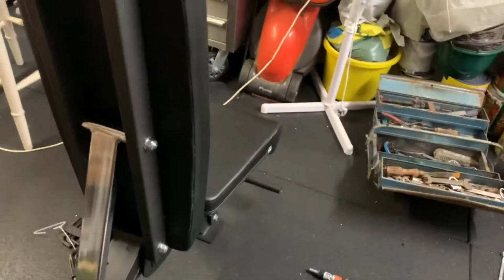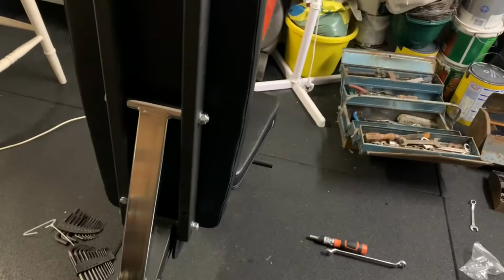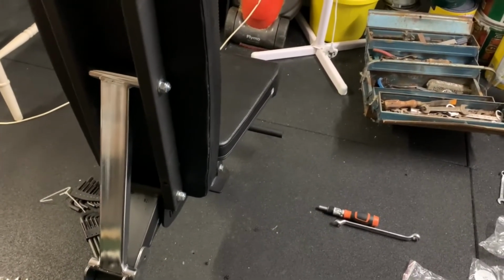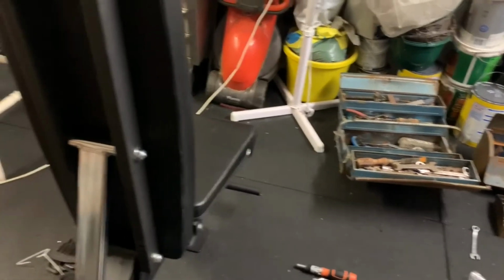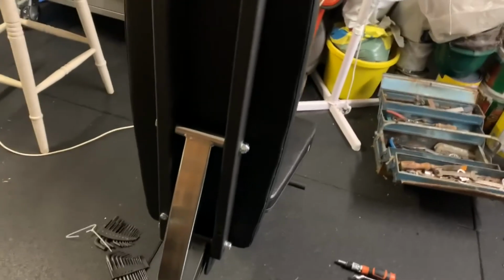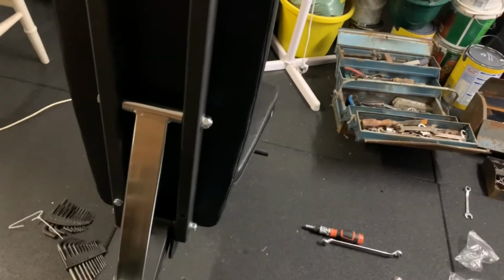You see, there's 1, 2, 3, none, because that hole just does not line up. The hole in the steel, there's just absolutely no way to get both of those screws in down there. And I can't even re-drill it in the wooden base because there's a brass insert, or it looks like brass anyway, in the wood for the screw to bite into, which works really nice on these. They're very tight, but it's well over a millimetre out on them last 2 bottom holes.